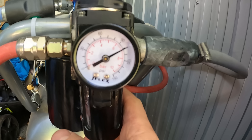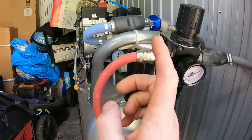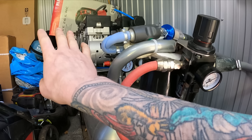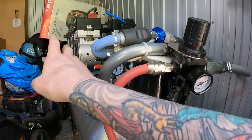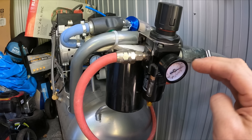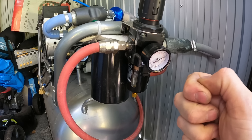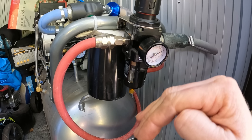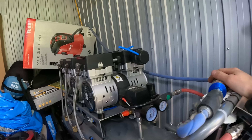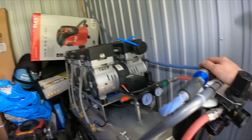You don't want to leave that flat out when you're painting. What will happen is as soon as the compressor is unable to keep up with what's in the tank — if you're using more air than the compressor is producing, that's when you'll get your fluctuations. But if you've already dipped the pressure down a little lower than where the gun's at, it's only going to dip the gun once the tank actually gets below that 90 PSI, if that makes sense.